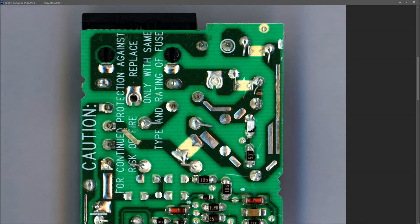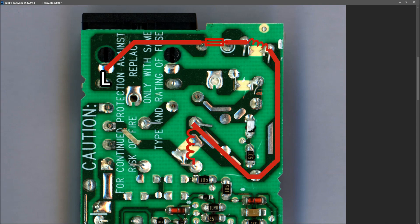Let's follow the path that our live signal takes. It comes in here first of all, and the first path is across to this position where there is a fuse — which I've already said is blown, but I'll mark in the symbol anyway. From there it's onto a first inductor, then after that inductor it follows this path around to a second inductor, and then it's meant to follow the path all the way onto one of the center pins of the bridge rectifier. But there's a piece of track that looks to be burnt off here.